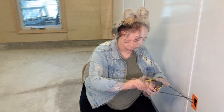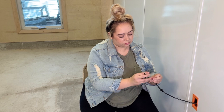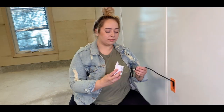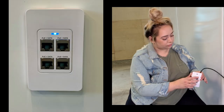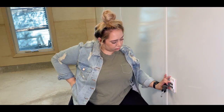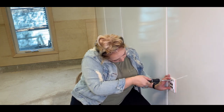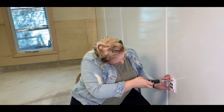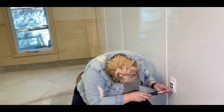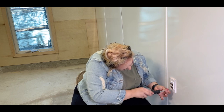Now just repeat this process at the end where your mounting bracket is. Instead of a network jack or outlet, I'm installing our GBT4IW. This is an in-wall gigabit PoE extender switch with IEEE 802.3BT uplink power. Simply bring in one cable run with 802.3BT power into the uplink port and you instantly have four ports of output PoE. With a 60W maximum output, you can power up to four 802.3AF devices or two 802.3AT devices. As you can see, it fits the size of a standard electrical outlet receptacle for a clean, flush-to-wall installation. I'll link this product in the description box so y'all can check it out.